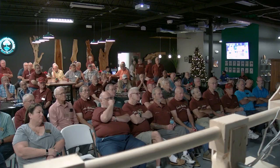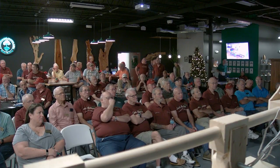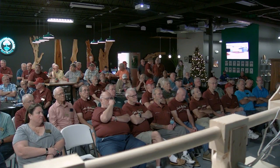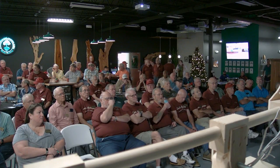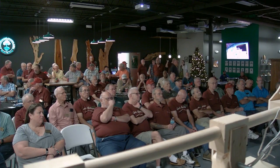Another piece of Norfolk Island pine. I took this to Frank's Turn and Learn Tuesday night. He looked at it and said it's gone too far — you'll never get a finish on it. Well, that's the thing about epoxy: putting on the first coats when it just soaks in, you can let that dry and then finish something. So I can let stuff go a little further because of that, even if it's spalted or whatever.